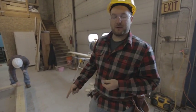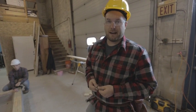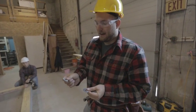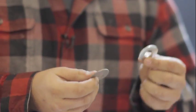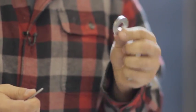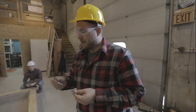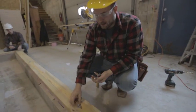It's really important: this is treated lumber, so any metal that touches treated lumber has to be hot-dip galvanized. We have two different washers here — a hot-dip galvanized washer and a stainless steel washer. They say you can use stainless steel, but I don't like it — it'll rot away after a while. So you want to make sure that your anchor bolts, washers, and nuts are all hot-dip galvanized.